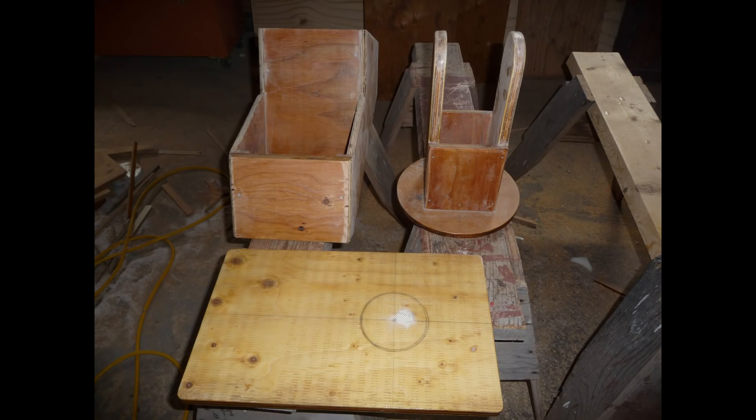In this photograph, I'm in the process of fiberglassing the components. The top of the bottom component — the flat surface the pedestal will rest on — has a layer of fiberglass on top. The sides of the base unit will be fiberglassed all the way around because they'll be exposed to the sea. The pedestal itself is just a disc that has been fiberglassed. The rest has been coated generously in epoxy, and it will get special treatment wherever the steel shaft goes through — the holes are drilled oversize, filled with epoxy and fibers, then re-drilled down to the size of the shaft.